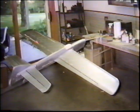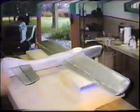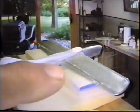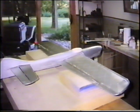And as I'm doing this, I'll put in the next picture just so this doesn't get too boring to watch. Anyway, if you look at some of the detail here, it looks like Sam has X ribs, which is kind of a unique thing. And you can see the white spots where he's almost sanded through. This is traditional. Talc is a good filler. It tends to be heavy. Two coats of light coat to seal a sealer. Notice I said sprayed, not brushed. Needless to say, it makes for a smoother distribution of the product.